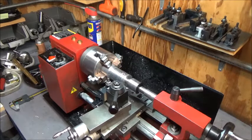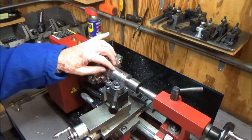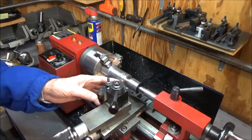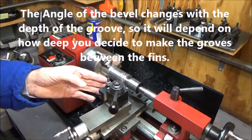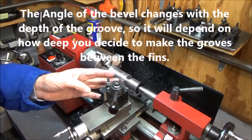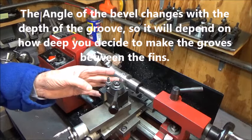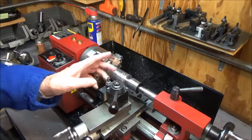The plan didn't account for the sleeve even though it asks for one if you're using aluminum for the power cylinder — it didn't account for the sleeve as far as the depth of the fins are concerned. So when you change the depth, you also have to change the angle of the bevel between the fins. That changes from three and a half to five and a half degrees. The depth can be whatever you feel safe with, but I reduced the depth quite a bit — probably about a hundred thousandths, for a 65 thousandths wall thickness. I don't think it makes any difference one way or the other; it's going to look the same.